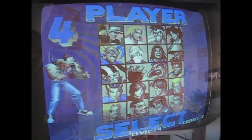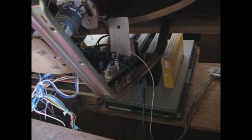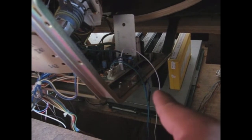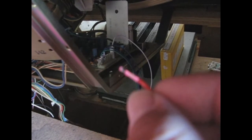There's just something wrong. Take a look at how it looks right now — I'll tell you the reason why it looks like this. If you look on your monitor, I believe it's called the chassis board, you've got these cables that need to get hooked up. In my monitor installation videos I've showed you which cables go where, and you'll notice the red one is missing — it's right here. This has come loose from the position it's supposed to go. The red one actually goes in the first prong right there. So I'm going to go ahead and install this and we'll see what the picture looks like after.